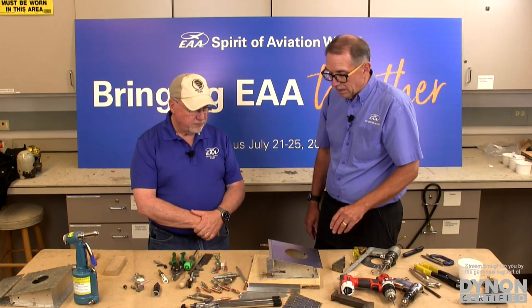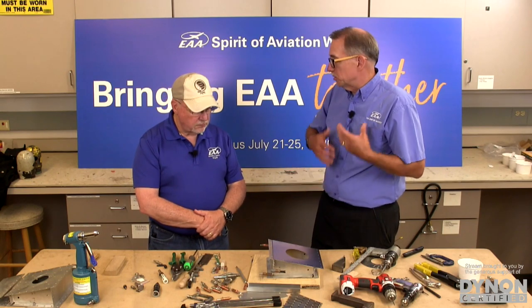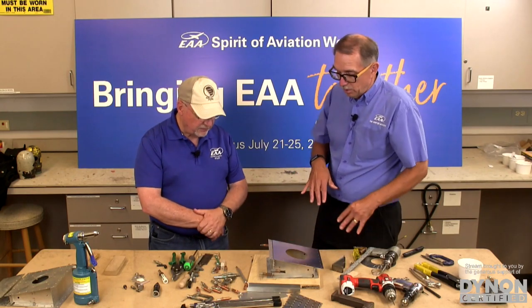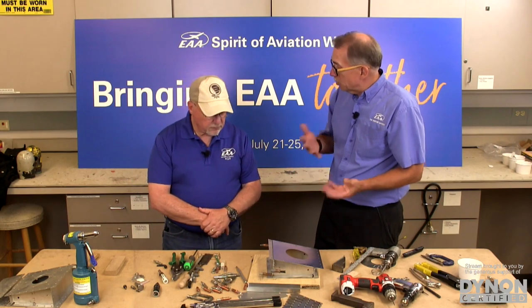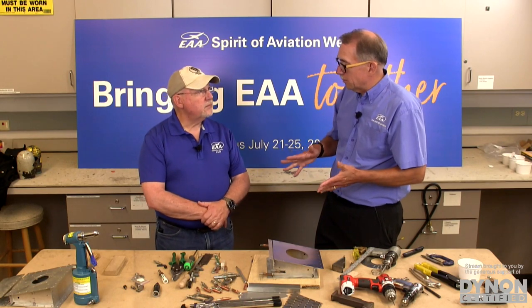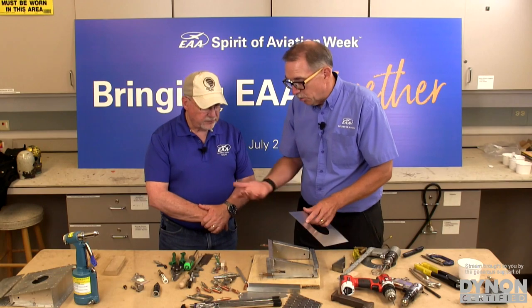Sure. So the basic steps in building a sheet metal airplane are laying the part out, cutting it to the right size, laying out the holes. We've got that partially done with this. Yep. The next part is deburring and cleaning up the part after you've cut it out or modified it. Right. So that's important. Deburring is getting the rough edges off the part, be it in a drilled hole or around the edge of the part. And that's done with some special tools.